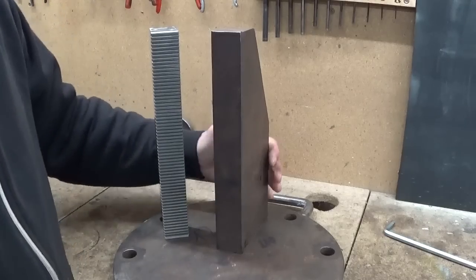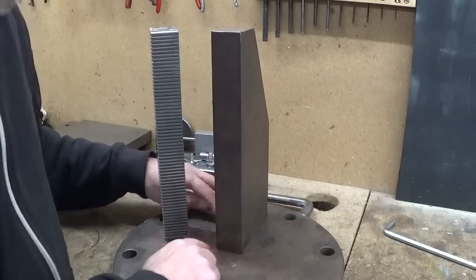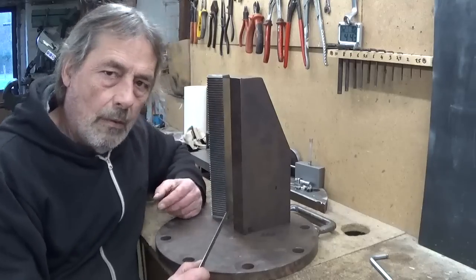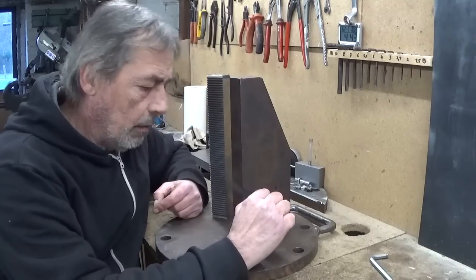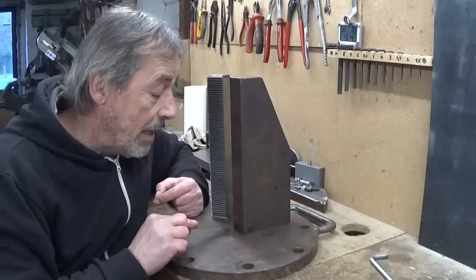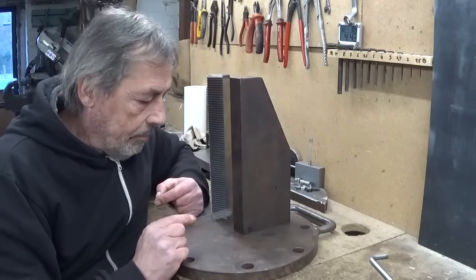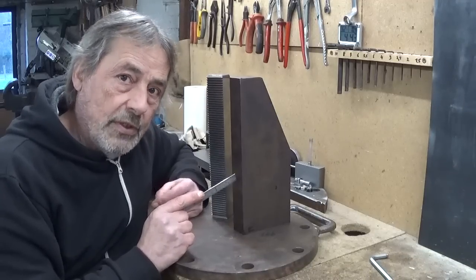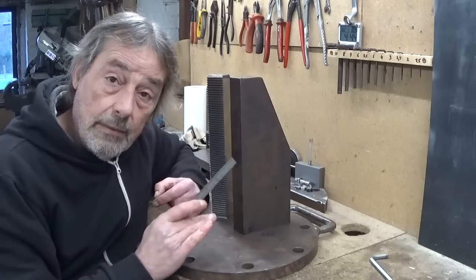Now that the thing here is assembled and I think it looks more or less good, a question could be, of course, did it fit from the first go? Of course not. What a stupid question. I measured this thing with my little scale. Oh, I say that's a 40 millimeter plate. So I made the pocket 40 millimeter. It didn't fit. So I remeasured with my calipers, it's 40.5. So I had to recut, but now the thing fits.